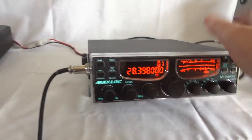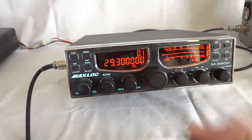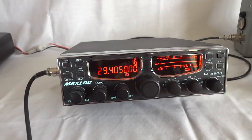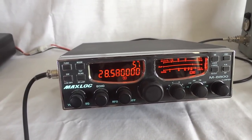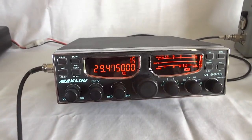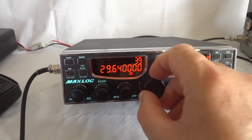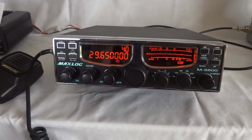The radio has a traditional size for a CB radio, basically. There is a mobile bracket and up/down buttons on the microphone so you can do that too. I have the programming set so it kind of covers the 10 meter band logically, with 5 kHz steps, and then as you get higher it goes to 10 kHz for the upper channels. You can program each individual channel any frequency in any mode you want — very versatile.